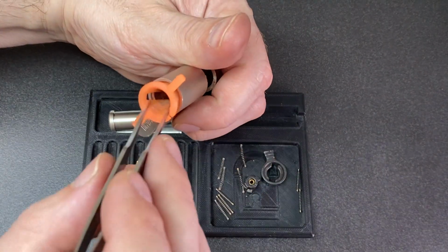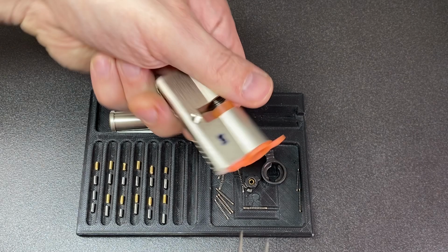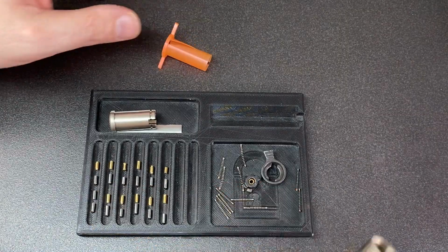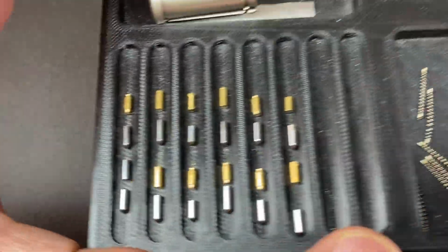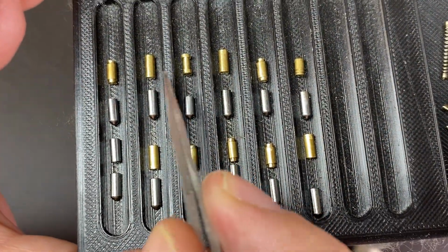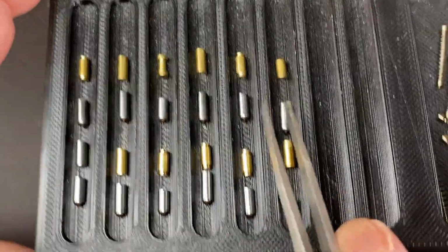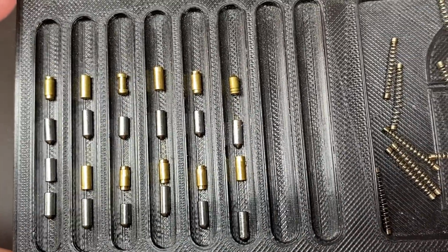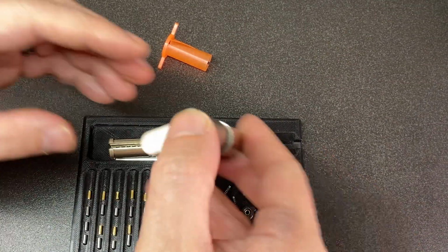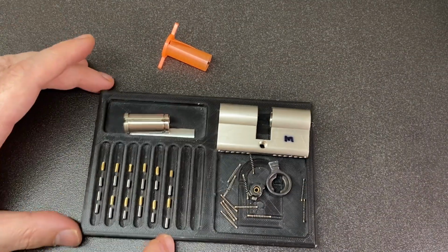And some springs come out, you not to wreck these springs, they're quite nice little springs. Yeah, so it has been modified slightly. We have a spool pin in one of the positions, so it goes T-pin, standard, spool, standard, T-pin, serrated pin. So it was modified, but not in a way that is significant, I'd say. So there you go. That was an IFAM M2 with one side standard, one side modified. Kind of a nice bit of fun.